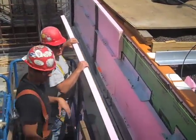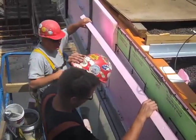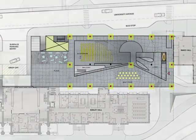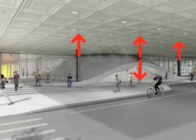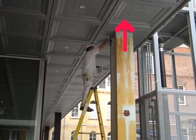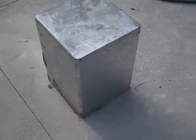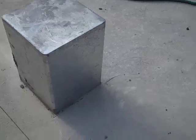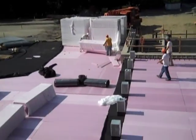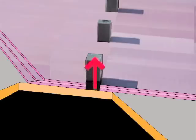This is not a problem for the stone, but it does create quite a bit of thermal bridging, since the insulation must be cut around these highly conductive metal pieces. Major thermal bridging also occurs where uninsulated exterior columns penetrate the dome and soffit. Here we see columns in relation to the frame above, and here is a column still uninsulated and directly connected with the interior steel framing elements being painted. Another area of thermal bridging occurs at building separation joints along the perimeter of the studio floor and roof, adjacent to Rand and Sibley Halls. And finally, a series of metal bollards placed directly over heated basement space are fastened not to the surface of the topping slab, but to the structural slab below. In this way, they interrupt all the layers of rigid insulation placed between the structural and topping slabs, forming a direct conduit for heat loss.